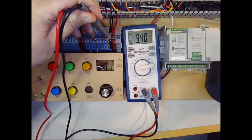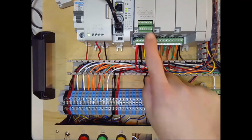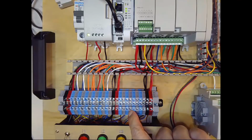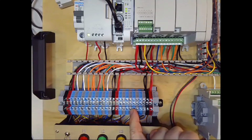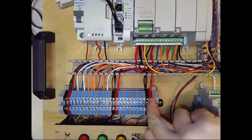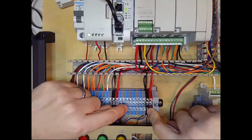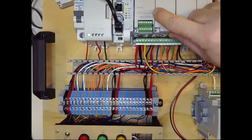Okay, let's look at how to connect that up to the PLC now. So now we're going to connect our IF2 input card to the potentiometer. And the potentiometer is already landed on a terminal block down here. So we'll use the signal coming from the terminal block on this white wire, gray block. We'll also use the 0 voltage reference. So the analog signal will be between our 0 volt and this block here. So we need to bring those up to the common. Terminal 6, B6 will be our 0 volt reference.